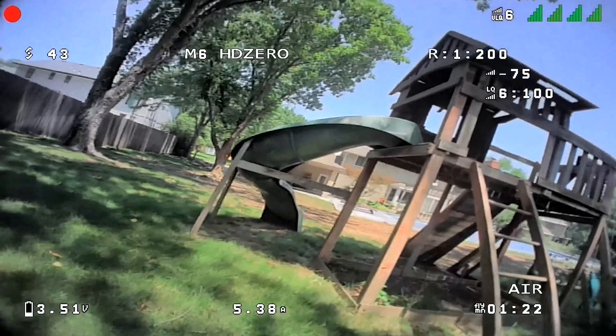If you don't have good connections on both the board for the MIPI cable as well as on the camera, you need to firm that up — these can come off in crashes. In all the crashes I had, I did not have either one come loose, but all crashes are different. You can have a terrible crash and think you just broke everything and the quad flies away fine, then have what seems like a minor crash and the quad doesn't power up anymore.